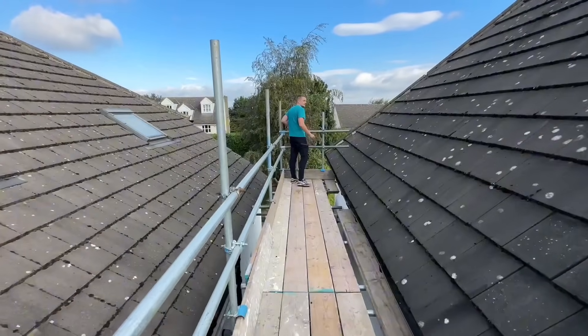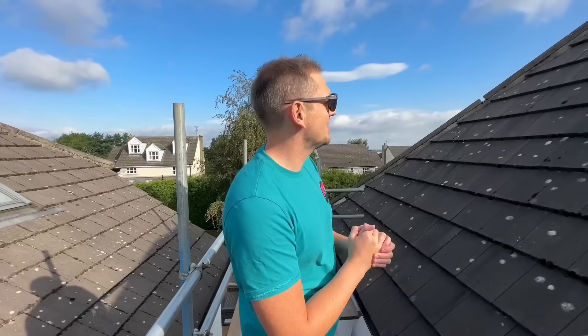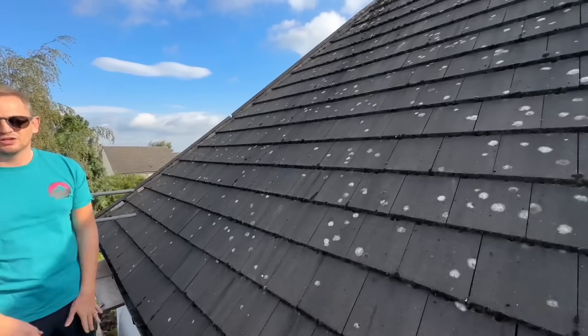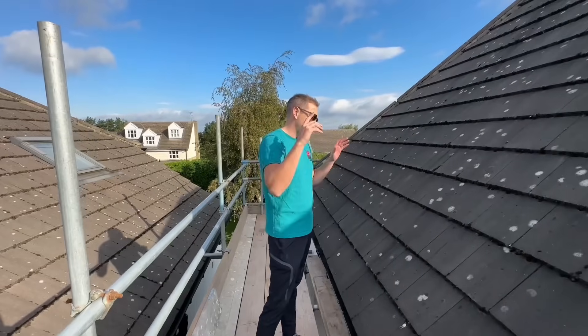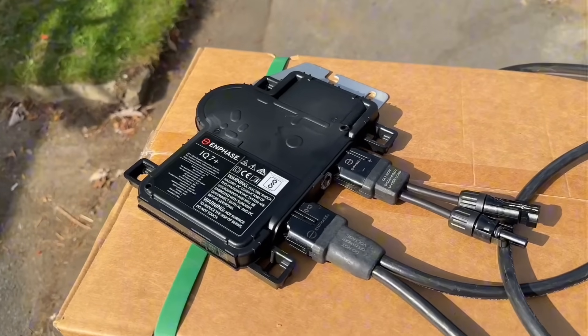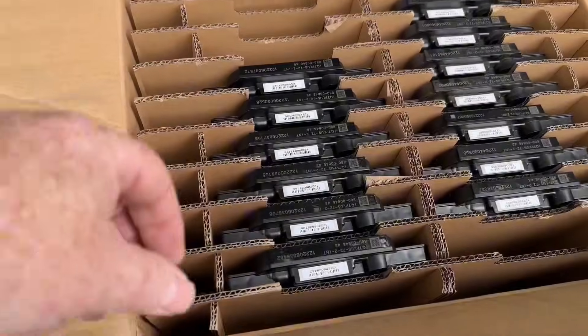What we're doing today then? From memory, ten here or eight here. So we've got the south elevation and then this is the west elevation. Because we've got a microinverter, we haven't got any stringing to worry about. So even though we've only got four panels on that south elevation — which is the only real available room space there — it won't affect this array. They're all independent, and we'll be able to share the generation once it's all set up.